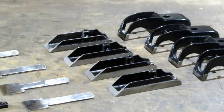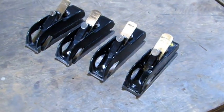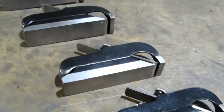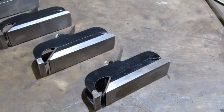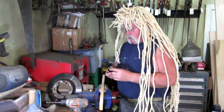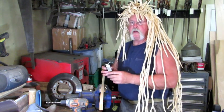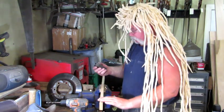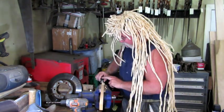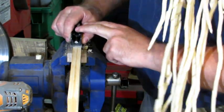Let's put them back together. There they are — four stunning Stanley number 75 bullnose rabbet planes. Let's get a good look at them all around. All four have razor-sharp irons and these beautiful planes are ready for a test drive. First up is the number 75 made in England. If you've never used one of these planes, you'll find out real quick that you want to have that throat closed as much as possible, otherwise it's a real pain to use.